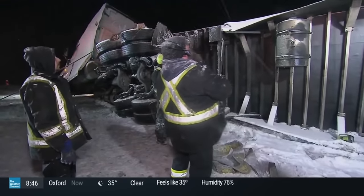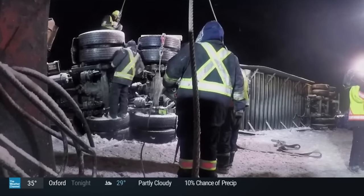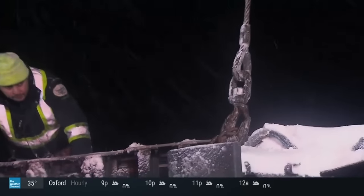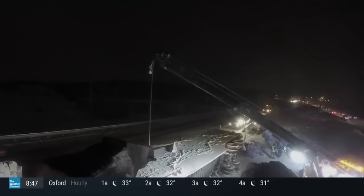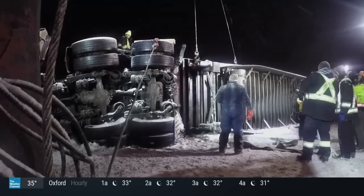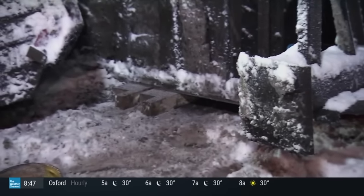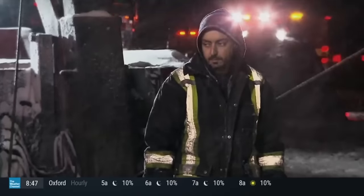Just gonna lift the front of the trailer so we can get the straps in over there. Now he swings the boom to tackle the front. Okay, going up. I'm already 73%. Reaching from farther away reduces lifting power. Bubba's barely started lifting, and he's close to maxing out the rotator. Might break. It's heavy. Now that's where I'm a little worried, if we actually got enough weight out of it. Boom is at full extension. The further the boom goes out, the less capacity it has.